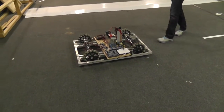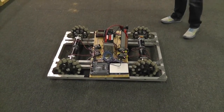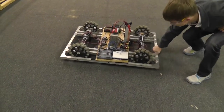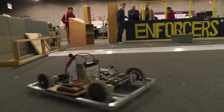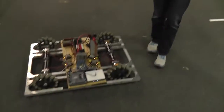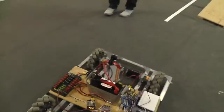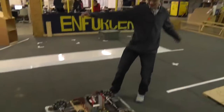Alright, Rob — hold and stuff. So our robot doesn't like being rotated. It can be moved left and right, but it won't budge in terms of angle — it just refuses. If we try to move it in, it won't. And if it winds up, it'll automatically correct no matter what. There's a little bit of drift — we're using a slightly older gyro — but for five minutes of tweaking, just a couple days of code, and an old gyro, this is fantastic! Imagine what we can do with a bit more work. It moves forward and side to side, not perfectly, but rotating it — it never allows that.